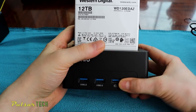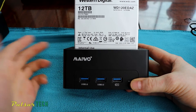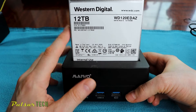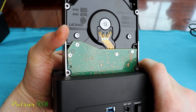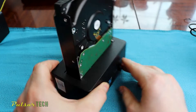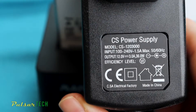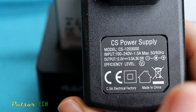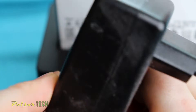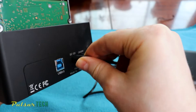You might have seen this docking station on my channel before — I'll put a link in the upper right corner and in the description. It's a nice docking station that lets you use internal hard drives as external hard drives, handling up to 16 terabyte. I'm using a 12 terabyte drive. It's powered by DC 12 volt, so we're going to try if the power bank can run it. This is the original power supply: 12 volt at 3 amps, which is 36 watt — more than the power bank's rated output, but the station likely doesn't need all 3 amps. Let's confirm we're still getting 12 volt output.